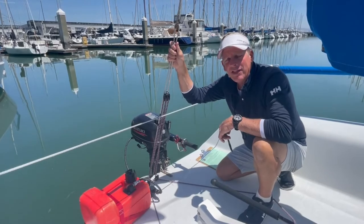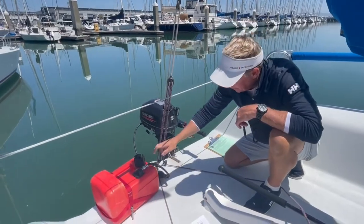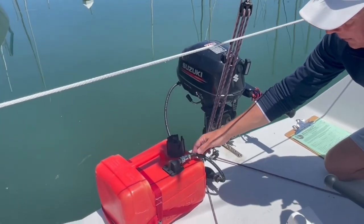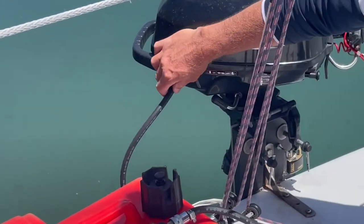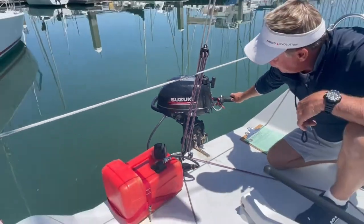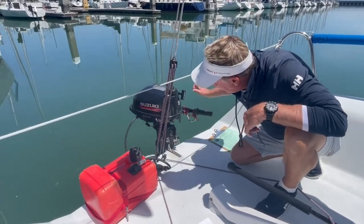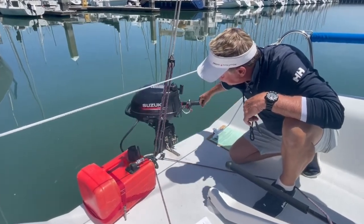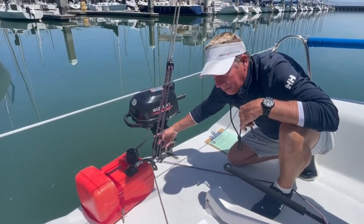Right away you should see how this setup is different than the teaching Andrews — in fact it's more like the J80. We have an external gas tank, and because we have an external gas tank, that means we have a fuel line that runs to the outboard. We want to check that connection. We also want to make sure this line has not been wrapped around the engine — just in case somebody has put it in reverse by spinning the engine, we do not want to see this line wrapped anywhere around here.